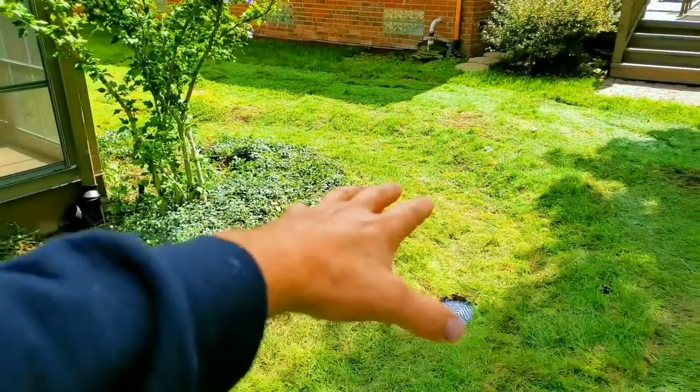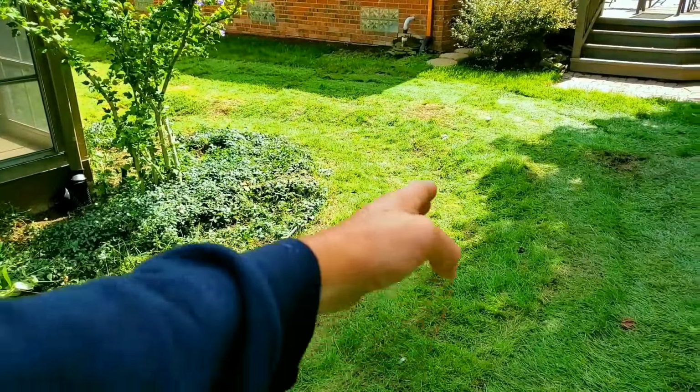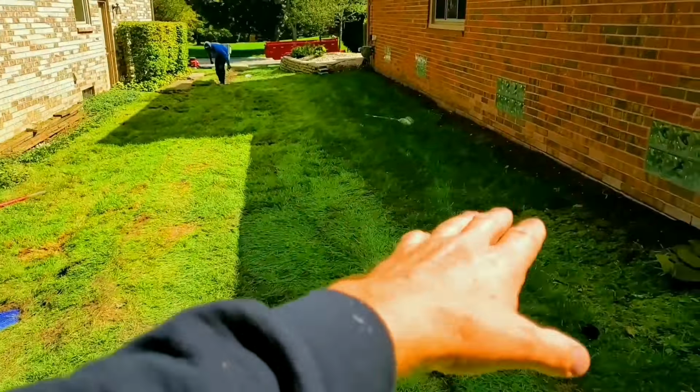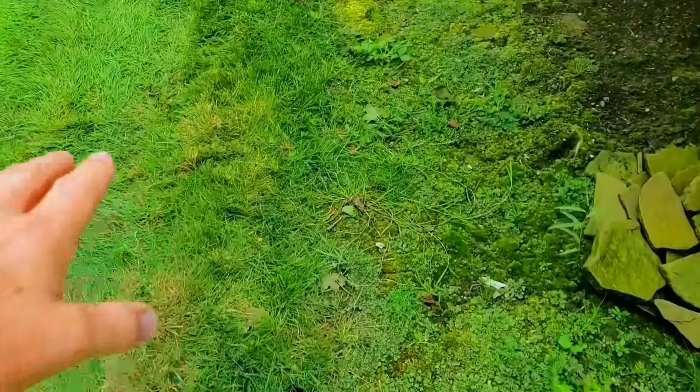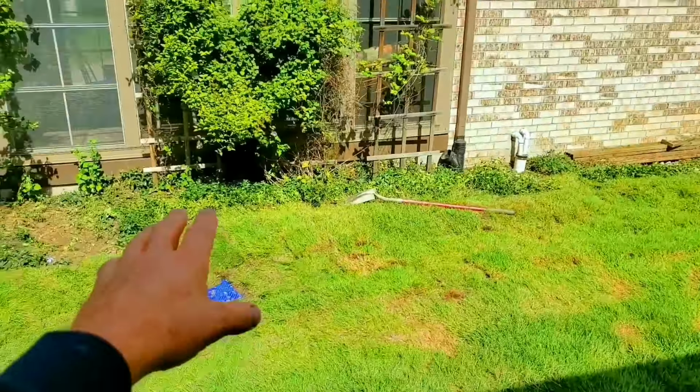And this was pretty high. The French drain's definitely the deepest through here, because we really had to cut through a high area and then feather it back real nice to create this nice swale. Now this house is higher over here, and the downspout water is literally running towards the client that we're here representing today. So we wanted to make sure that we had a swale that just caught the water.